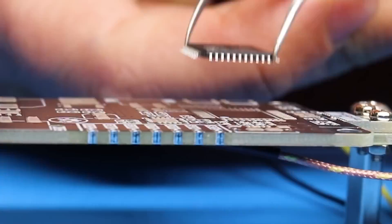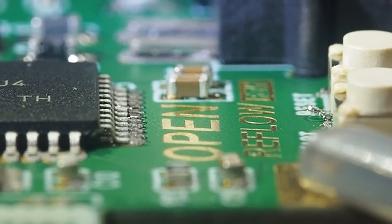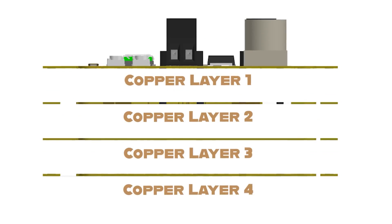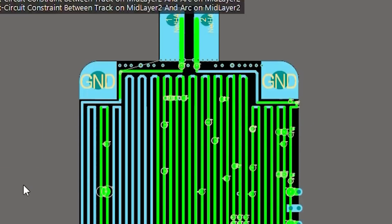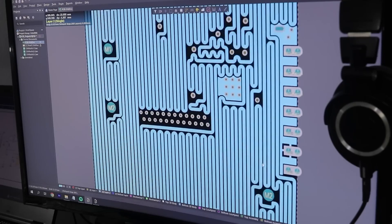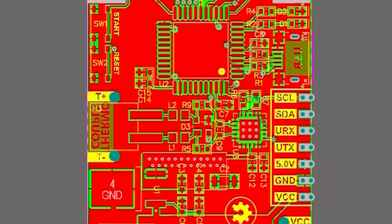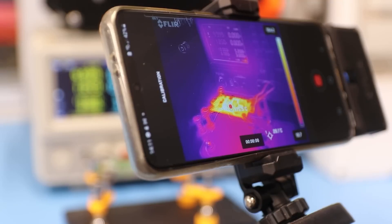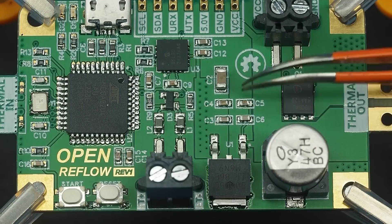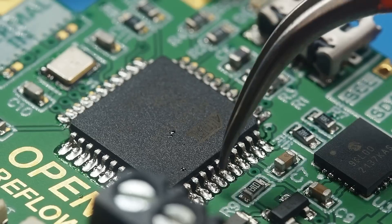More projects! Karl Bujeha has created a circuit that can solder itself. This is a multi-layer board that has a massive ground plane as its center layer, but arranged so that the circuit takes the longest path possible, covering the entire surface of the board — so it's also a massive resistor. When voltage is applied, the ground plane heats up to a temperature that can melt solder paste. The resulting circuit was a little messy, but easy to fix.